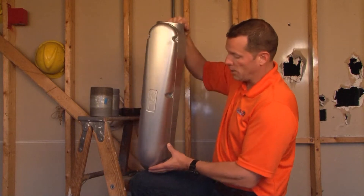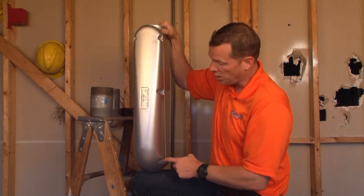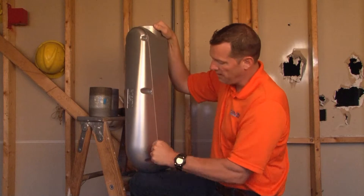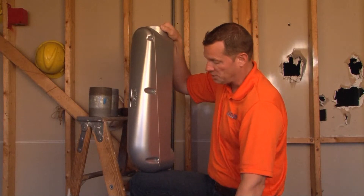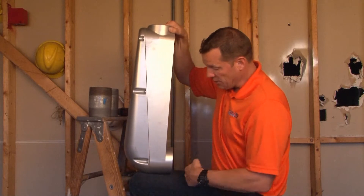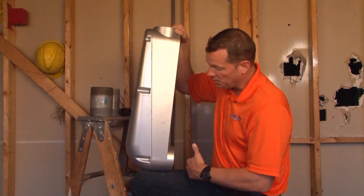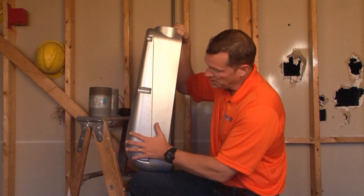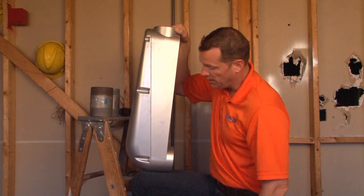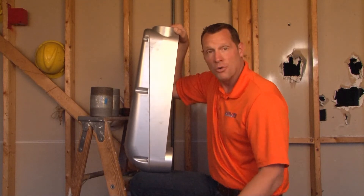After the raceway is in place, you simply remove the set screws along the sides of the cover and remove the cover, which allows you to pull the heavy cables in one direction and easily feed them into the other conduit at a 90 degree angle. It creates extra space so you don't have to worry about that sharp turn that standard conduit bodies often provide and force you to struggle with.